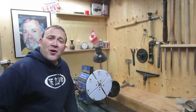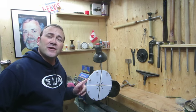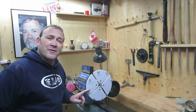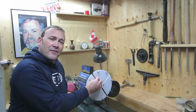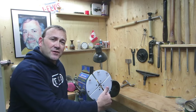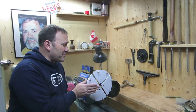And thanks for watching. I hope you found that somewhat informative. If you do not have a set of cold jaws, there are cheap ways of making your own. This literally cost me $6. I had some stainless steel screws knocking about in the workshop. I just need to get a little bit of rubber in there so that when I put my bowl in, I can tighten them down and hold that bowl in place. I would bring my tailstock up to finish it until I get that final nub, and then remove the tailstock and finish it up. But I'm pretty happy with these.